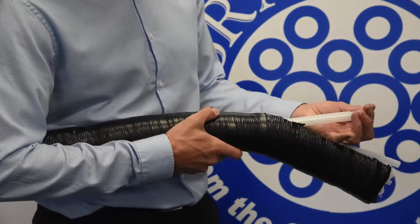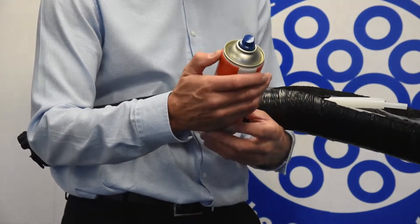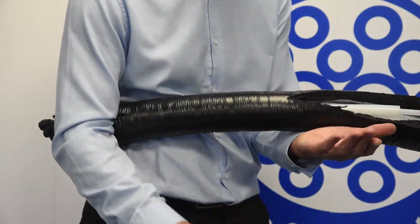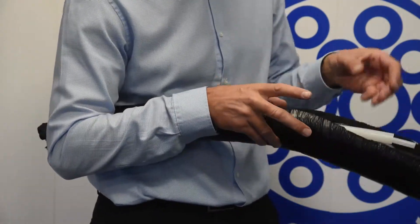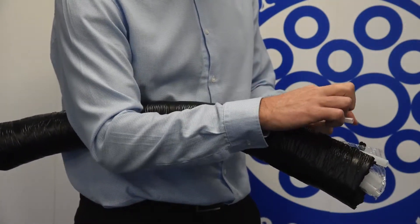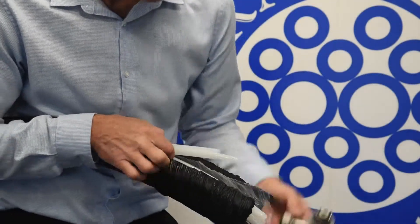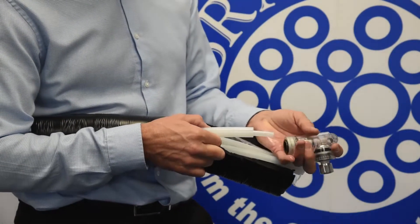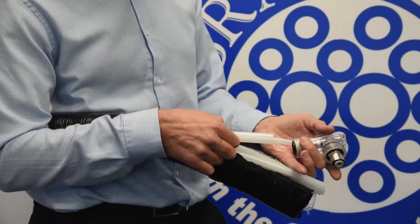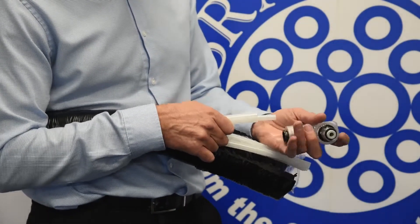At this point, to aid the pipe going into the fitting, it's a good idea to use some food-grade lubricant — just a tiny little bit. Place some around the outer pipe and a little bit around the 3/8" line. This just aids the pipe going into the fitting. Once you've made the cooler end, you obviously cannot move this pipe in and out, so you're relying on the friction fit and the pressure of the outer coaxial pushing it home.